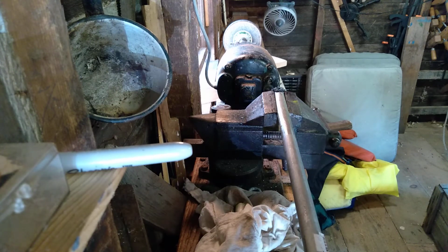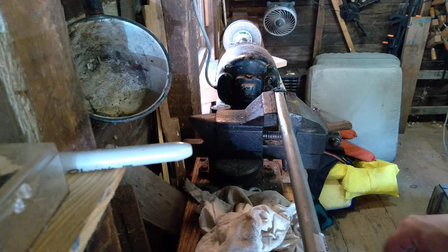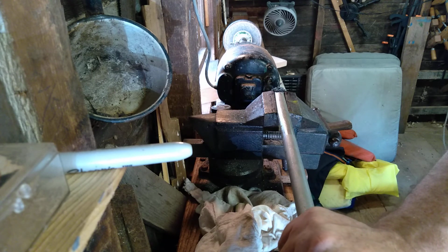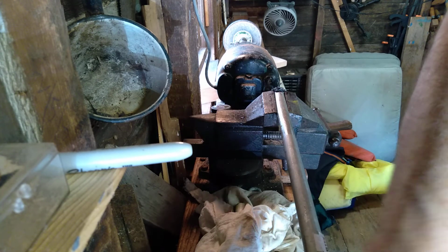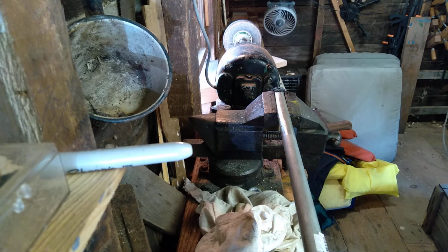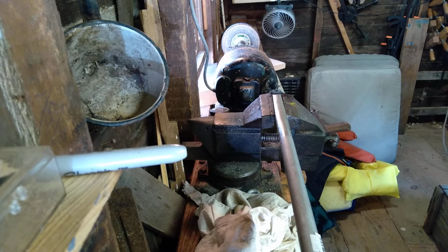Yeah, it definitely helps to drill a, I guess you'd call it a pilot hole. You use a small drill to drill out the web of the bigger drill, and then the bigger drill goes a lot faster. So we got that. Got to drill another hole on the other end for the handle. Then we'll be ready to knock this assembly together, which may actually just happen next video.